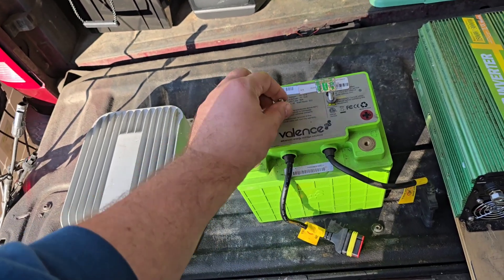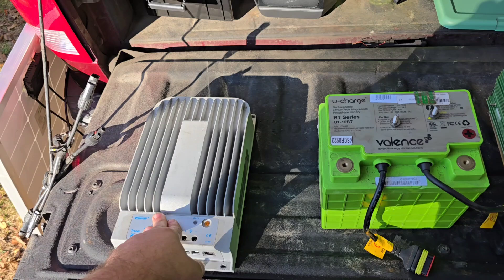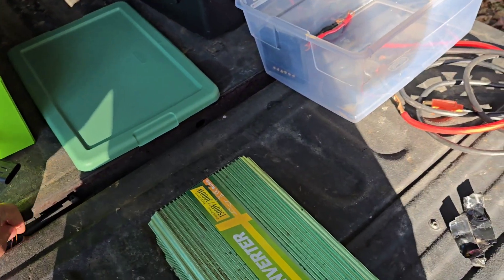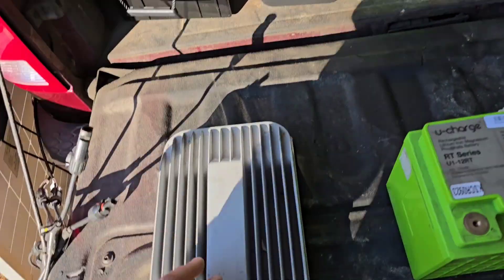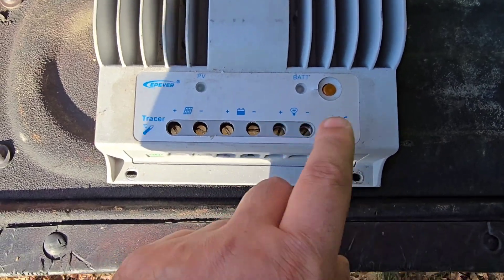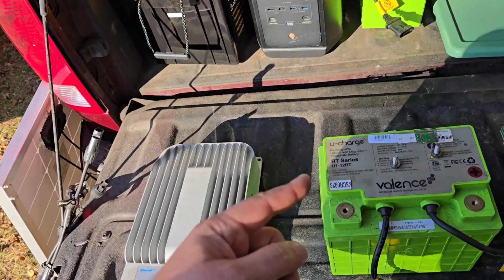We're going to focus on a single 12-volt battery. This is a lithium iron phosphate battery, but you can use a car battery in an emergency. You need a charge controller and an inverter if you want to run 110-volt AC — that's it. If you get a 12-volt fridge, they're pretty affordable and you can skip the 110 stuff entirely. You can directly power 12-volt things positive and negative out of the charge controller, or run it to a screw panel like you'd use in a car and just plug stuff in.